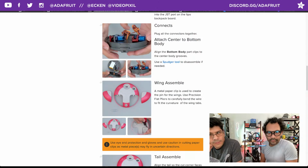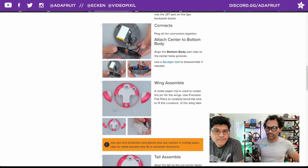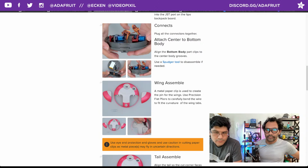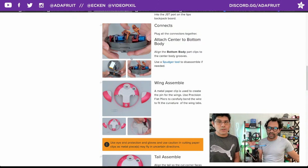So the servo horn is attached to the 3D printed arm. Is that right? No, the arm is attached to the servo, the horn part. You can see it there. It's attached, and then you use the 2 screws that come with it to secure it in place. So the servo comes with horns, and you're using the stock horn, right? No. You have to use a completely customized horn because it has that little arm.